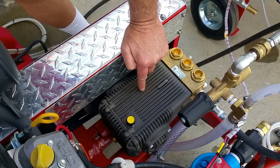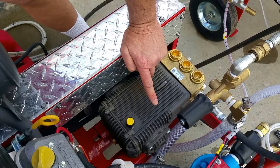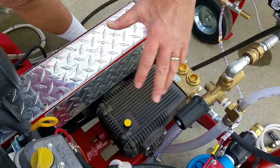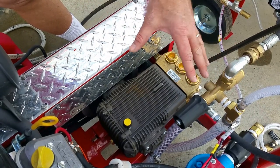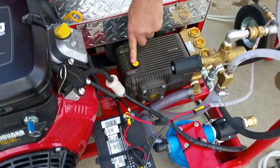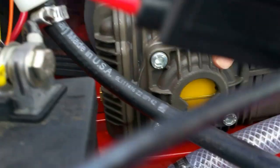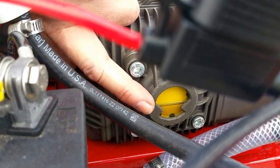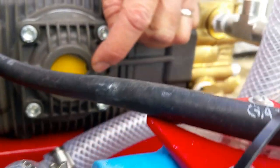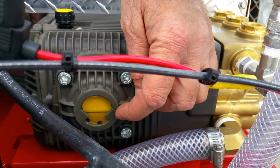You want to use a synthetic high-grade hydraulic oil in this pump to make it last a long time. When we plumb a system with a high-volume bypass line to prevent overheating, the least you can do is take care of the oil. These pumps are pretty much indestructible as long as you treat them decent. This is the dipstick used to check oil when you can't see the sight glass — this one has a sight glass on the front so we don't always need the dipstick. The indentations show where you want the oil level to be, but that's actually the minimum level. We want the level slightly above that; factories usually fill to the minimum, so bring it up a little.